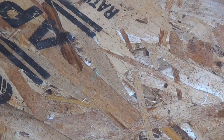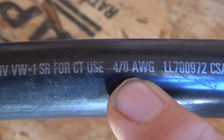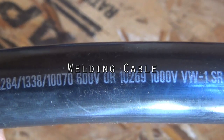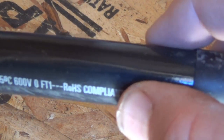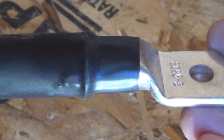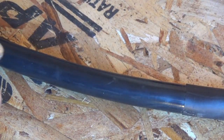Now it's time to do the wiring of our cables on the batteries. This wire we're using — there's the gauging right there — four-ought. When it has four-dash-zero, that's called four-ought. Some people call it welding wire. Inside this is like a million strands of wire. He put these together for me for the proper size — one in red positive and the other in black negative, so it makes it a little easier. The batteries came with these bolts, about an inch and a half.